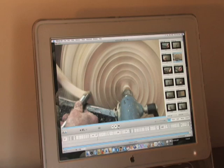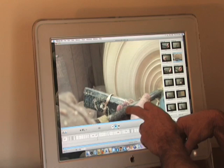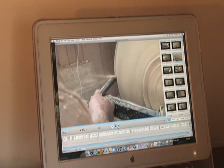Okay, here's the 5/8 inch bowl gouge here in action. You can see I'm taking some really hefty cuts here, and I'm not getting a whole lot of vibration in my hands, and that's because of the heft of the tool here, and I really appreciate that. Now, I'm just taking care of the exterior of a bowl here, but this tool will handle any job that has bulk removal in mind just before you get to the designing portion of your turning. Let's take a look at the 3/8 inch bowl gouge and what it does.